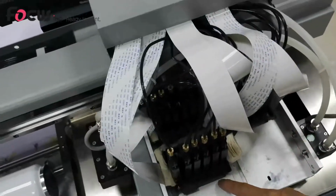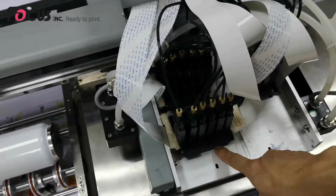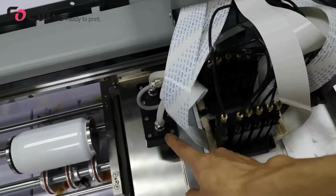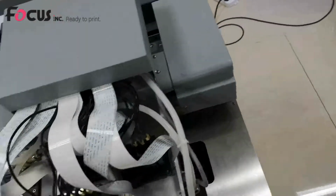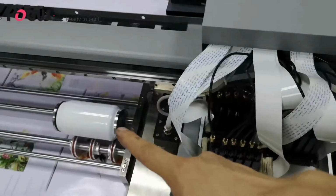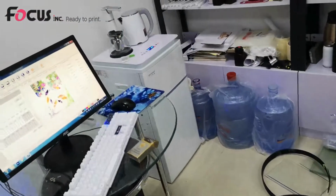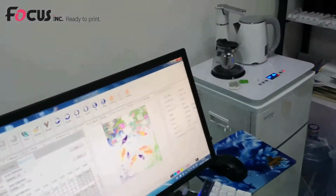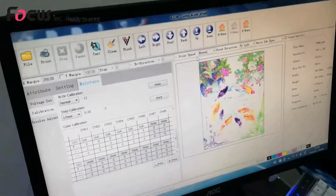and also take out the varnish print head to prevent clog by the strong UV light. And then the round size of the medium must be the same as the head, or smaller than the head of the printing job. So this is the printing procedure for printing with the rotary printing device. Thank you.